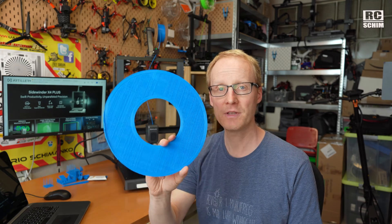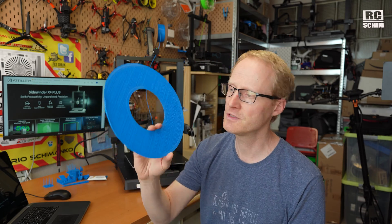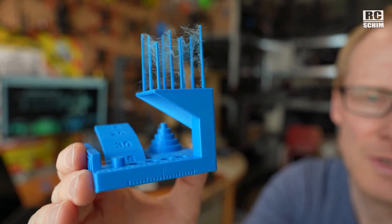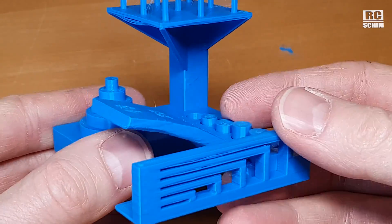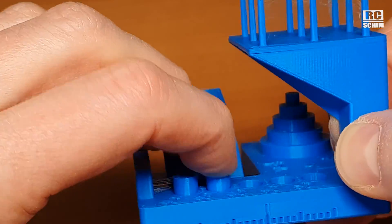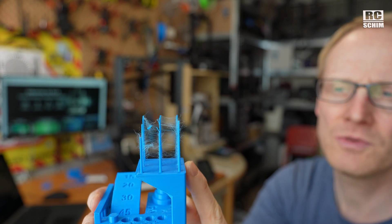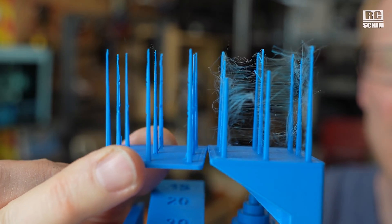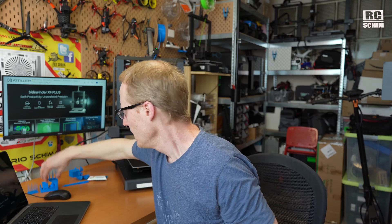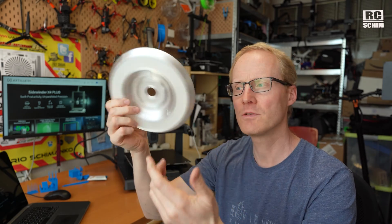Why is there no option for a bigger nozzle? Why don't they even install a bigger nozzle in the factory? Because with a 0.8mm gigantic nozzle you can print way faster without having to move fast — because it's a fat nozzle and fatter layers mean you are finished with your prints sooner. This is the Orca FDM tolerance test. You can see some ghosting going on where it printed a bit faster. The overhang is actually not too bad. At 0.3 tolerance it can be broken loose. There's a terrible lot of stringing at 220 degrees — I needed to go down to 205 to make the stringing effects almost go away. I have terrible retraction settings but I don't care too much about stringing on functional parts.